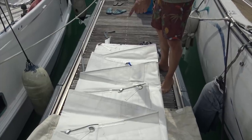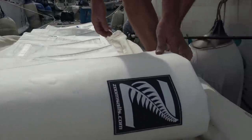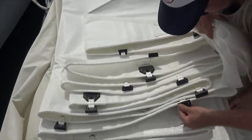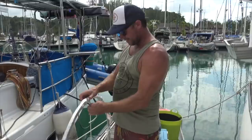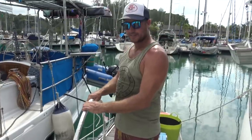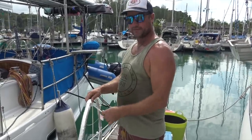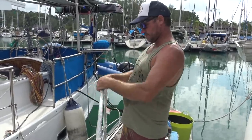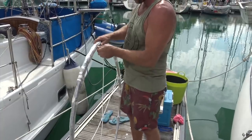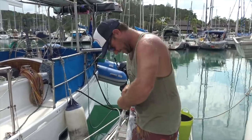We've got the foot, the reefing points, and we're rolling it down. All our reefs are in there ready to go. This round contraption holds the battens — straight poles that go inside the sail. We have a fully battened mainsail. Phil gave us instructions by email to be very careful unraveling them, because what's coming out is straight fiberglass from a round roll — we could potentially lose an eye.